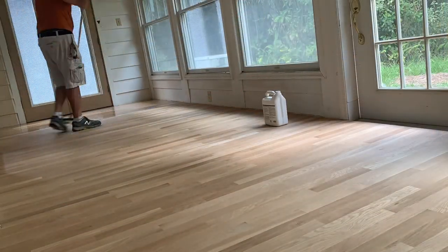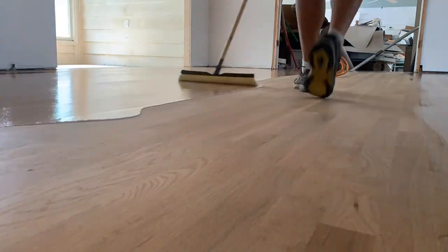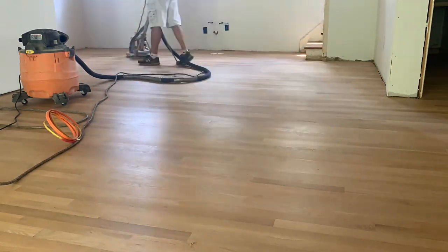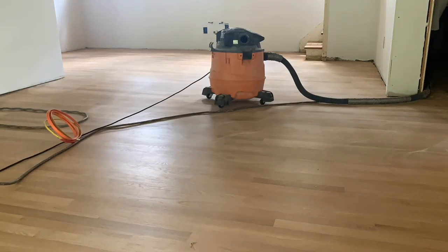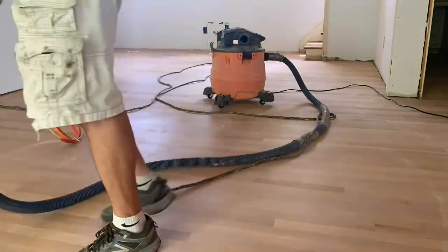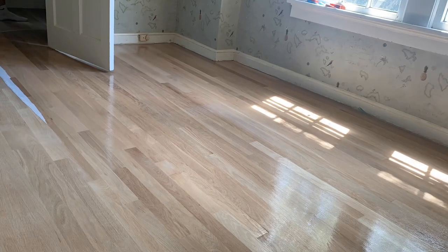Here you see me coating my way out. The next day, first thing in the morning, I'm coating the floor again. I want to build up that layer of protection because we are going to be buffing this second coat of finish. Because they're both water-based finishes, you're not going to have adhesion issues. After the two coats are on, I give it about three and a half to four hours to dry, come back, hook up my buffer, and go over the entire floor. I use a maroon conditioning pad with 200-grit sanding tape. You want to see the floor have a slight dust up, then go back over it with the vacuum, clean it up, and it's ready to coat again.